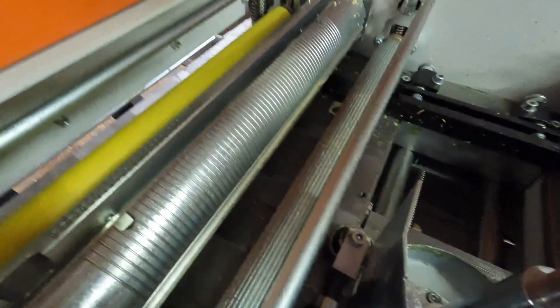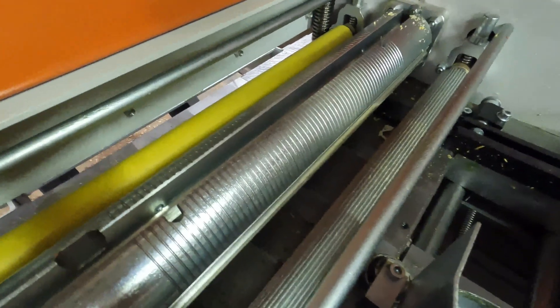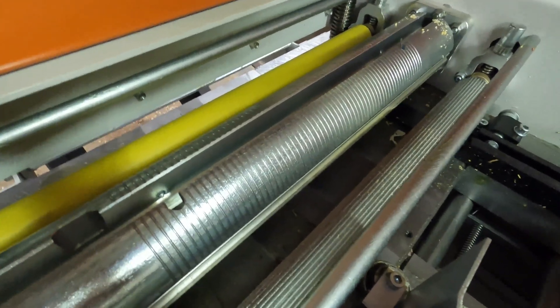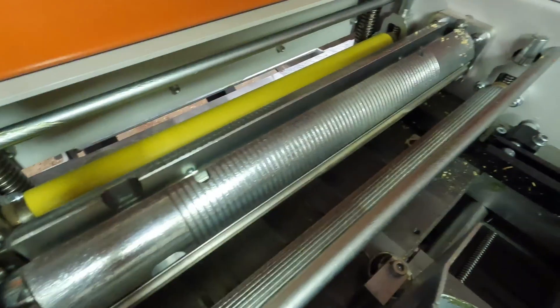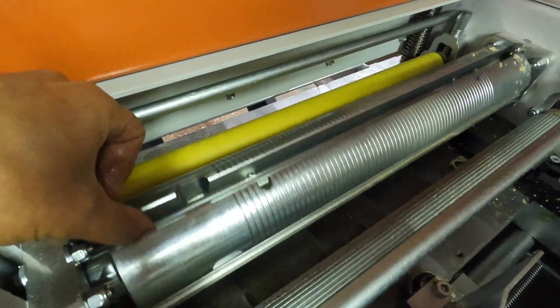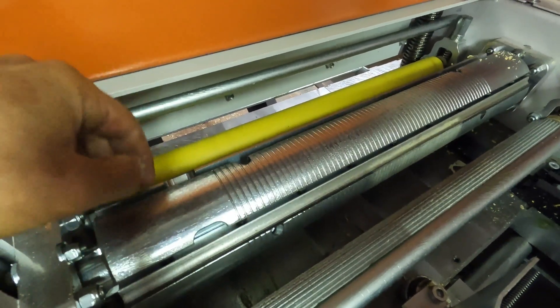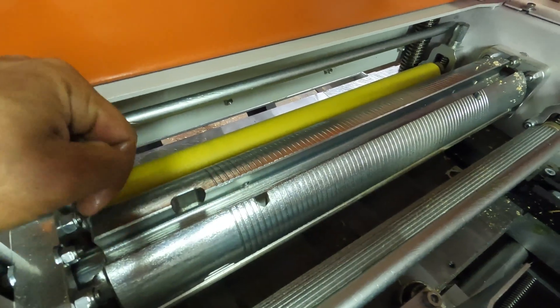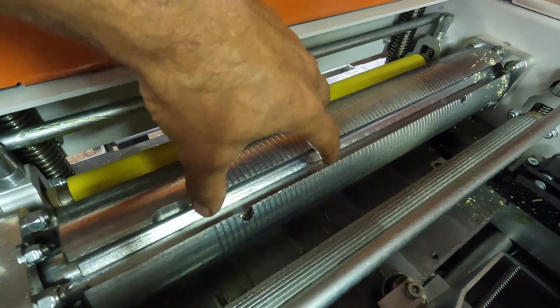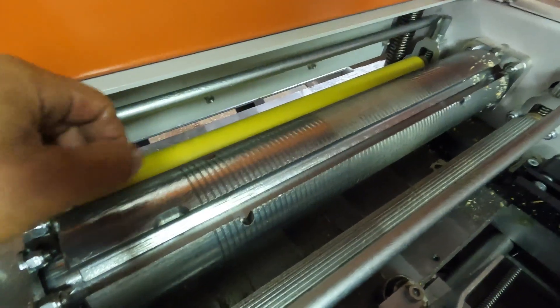The top head here — think of your standard wood planer — that's basically a big planer head. This particular machine can plane up to 20 inches wide, so that's a pretty wide head. Once again you've got planer knives and then you've got room for your molding knives. If you were running crown molding you'd put a big cutter here to cut that intricate detail of the crown.